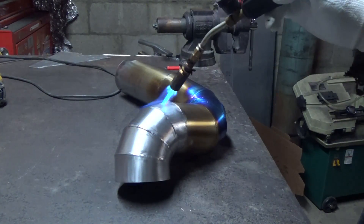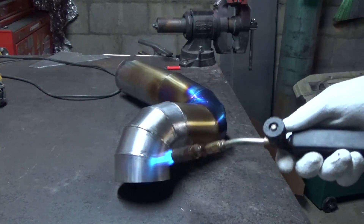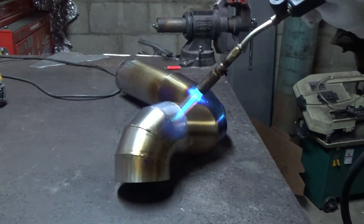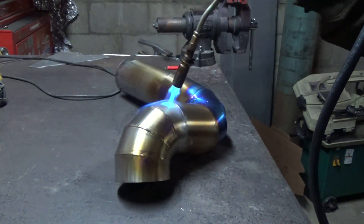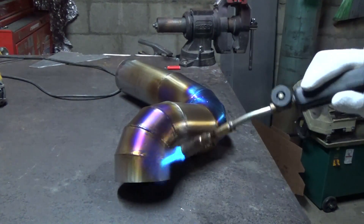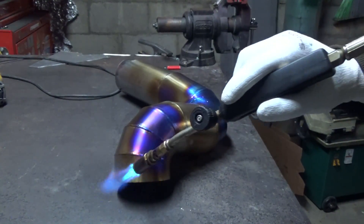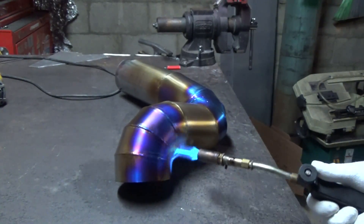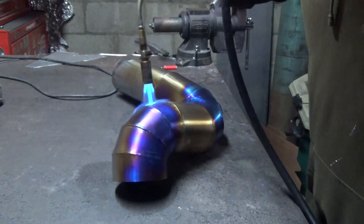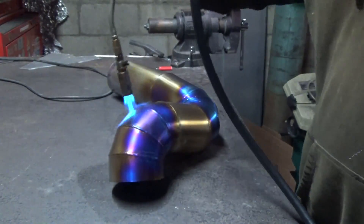We're going to start by heating up the whole pipe. The first thing you'll notice is I'll get yellow, and once everything is kind of tanned yellow, I like to just move around keeping the heat even until I start to see a purple. Once it goes from purple, it'll be real quick till it goes blue. Depending on what color you want, you're going to watch it — it's easier to hold at purple, but once you get into the blue it'll go from dark blue to light blue very quickly. You can see I'm starting to get the blues, which is the desired effect. If you have a spot that isn't heating up as much, you can jab it quick to get it to match the surrounding area, but be careful — if you let it go a little too long it'll get to that light blue.